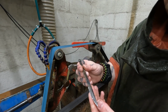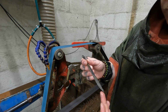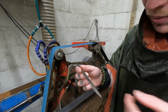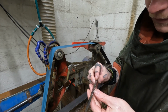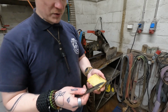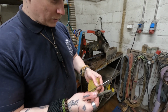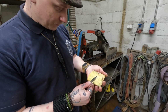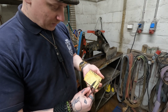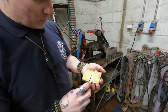Good, huh? So there's a nice fat burr on the edge here, which is a sign that it's sharp under the burr. Now I have a very hard 10,000 grit stone, and I remove the burrs on there. I keep the blade very, very steep on the stone.